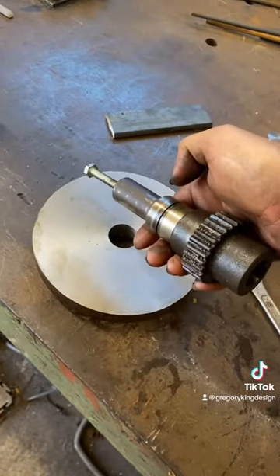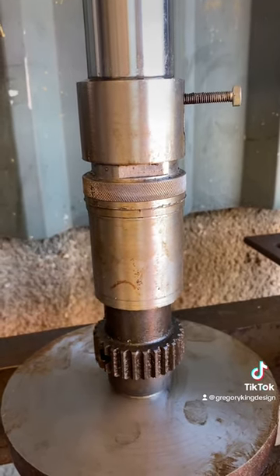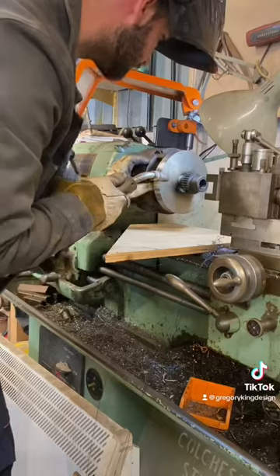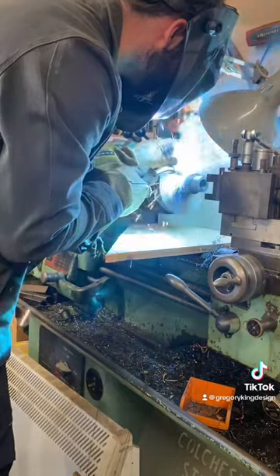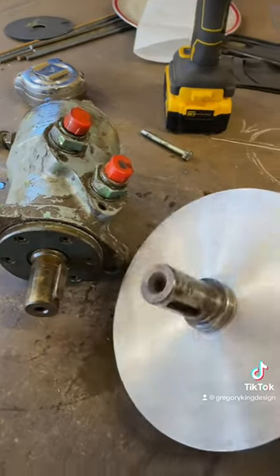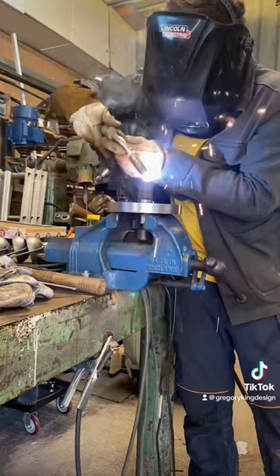The brake had a spindle with a keyed shaft in it, which we're going to use. We machined out the disc a bit more and then used the hydraulic press to push it in. The hydraulic pump off the press is also going to be used to run this hydraulic rotisserie. I covered up the bed on the lathe, then used the lathe out of gear to manually rotate it to work the weld around the shaft — it worked rather well. You don't want splatter on the bedways.